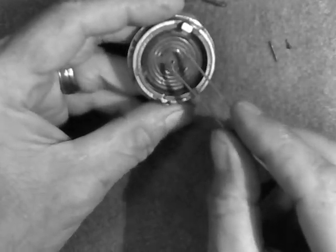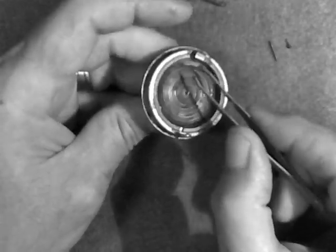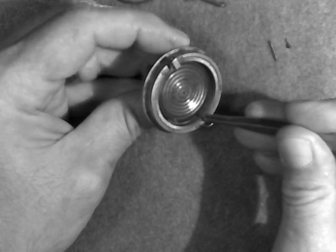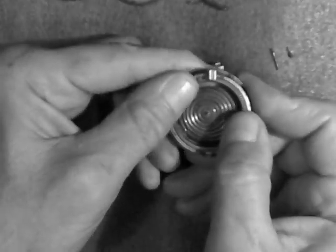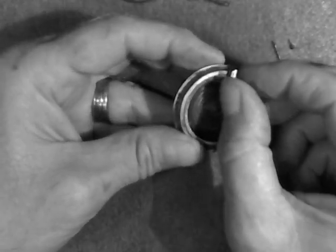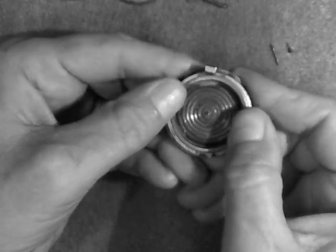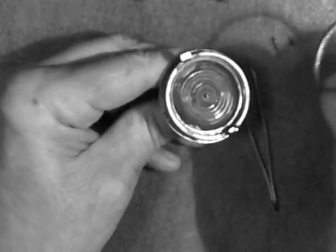This is the diaphragm itself — this is what's actually making the noise. You can see this one is really badly rusted, which is surprising. There's a retaining ring right here, and it's knurled at the top to give you something to push against, but it actually has two cutouts. First we're going to see if we can move this ring at all, just using our thumb. It started to unscrew. If you begin to unscrew it, it's going to hit the hinge block and stop. So just turn the hinge block out of the way, and now this ring can go right past it. We just slowly unscrew this retaining ring until it comes completely out of the threaded body.